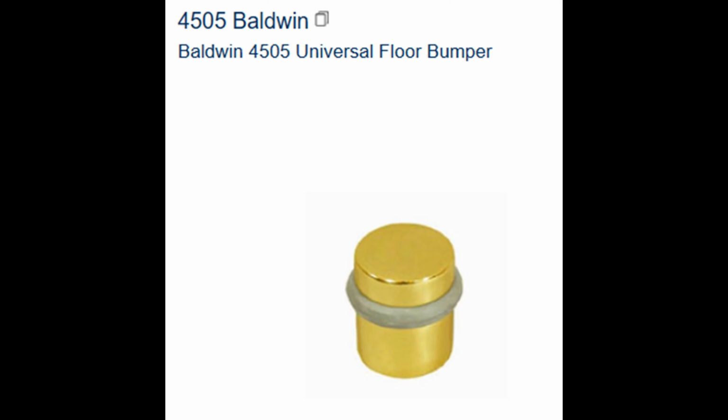Is this residential? Yes, high-end residential. I really believe if you took some E6000 and you put a case of tiles on it overnight, I bet you it's going to work. Because how hard does the door actually hit the stop? It doesn't hit it very often, and people aren't pushing against it generally, right? The problem is the vacuum cleaner. That kind of thing is what breaks those. You're not going to have a vacuum cleaner on the tile floor, but you might.